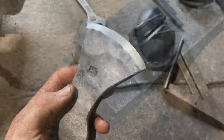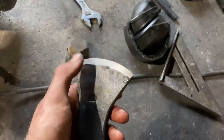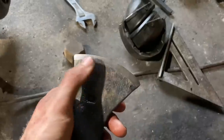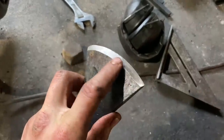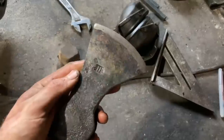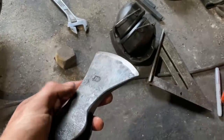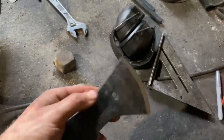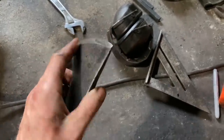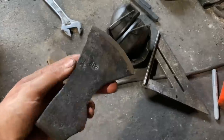We'll go in and start grinding in the cutting edge. I checked it with the Rockwell files — the 60 file bites really easily, and the 55 skates just a little bit, doesn't really bite much. So we've probably got a Rockwell around 56-57, which is a tiny bit on the high side for an axe but not unheard of — a lot of really big camp knives are tempered to 56-58. I'm going to leave it right there, take the cutting edge up through the grits, get it sharp, and keep moving.